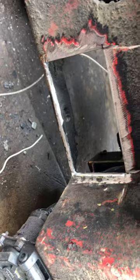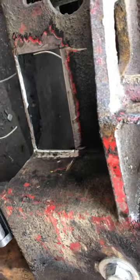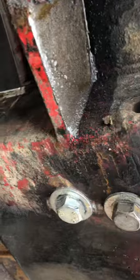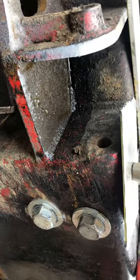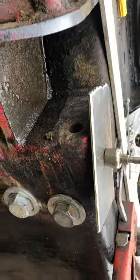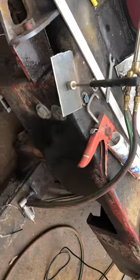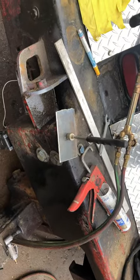So you take that bevel and multiply it with this bevel, and you've got a halfway decent little bead of weld sitting in there holding your plate in. Not only are you filling the hole, but the old thing's still pretty tough. If you ram it into something or hook a chain to the bumper, you're not going to pull a chunk out of it. So that's kind of a semi-pro tip. A pro welder already knows all this, but for guys that are learning this stuff, if I can help you, I will. There's how you do that, and it works every time. You grind it off flush, and you don't have to worry about it falling off or cracking right around the weld.